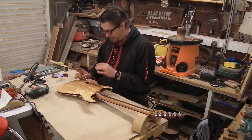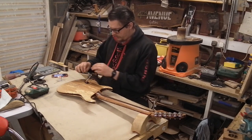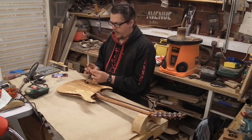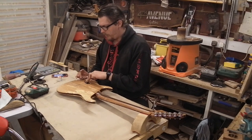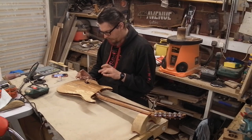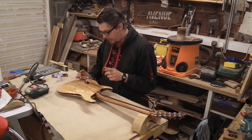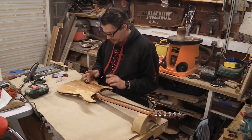So, if I have on my switch in the down position, if I solder the white and black wire, and for the up position the white wire, and then I run the connection from that back to ground on the back of the volume pot, that should give me coil splitting and a working pickup in theory. So I'm going to start soldering this and hope that I'm right.